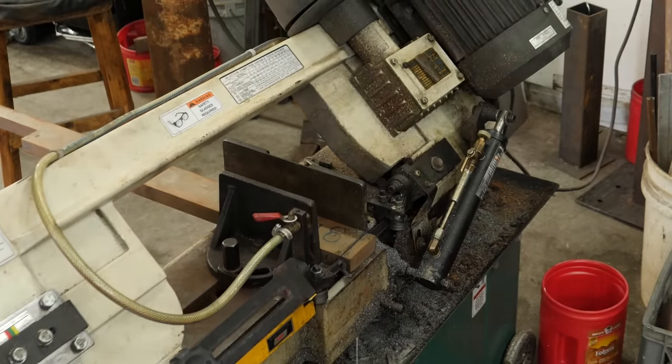I'm done shaping the outside of the pommel — I've got a 320-grit finish on it and it's somewhere between 30 and 40 thousandths of an inch smaller than our handle material. We still need to dome the end of the handles. To hold my piece I've got a block of wood with two holes drilled the same distance apart as the pins so I can take it over to the grinder. I add a little bit of blue Dykem layout fluid, dry it off with a hairdryer, and scribe some lines. With all the shaping done on the end of the pommel, this knife is really starting to shape up.